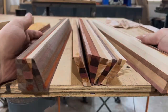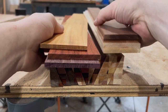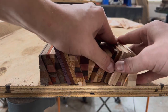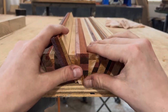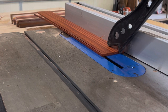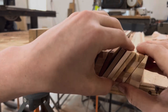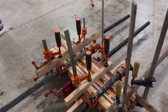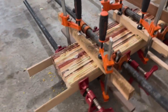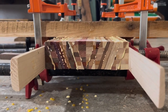After finally cutting some zigzag cuts on the table saw, this is what I'm left with, and I decided to spice up my design a little with some leftover pieces lying around — I just slid them in where it looked best. It's important to cut all these pieces down to the same exact height as all the other pieces because it makes glue-up ten times easier — trust me, I found that out the hard way. Here is my death contraption I rigged together to get this thing glued up nice and tight without any gaps or seams.